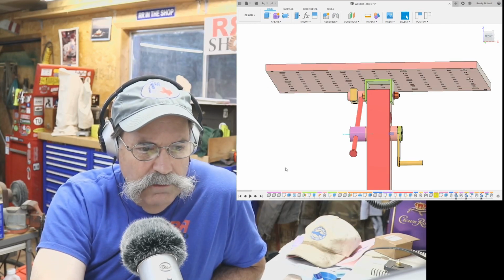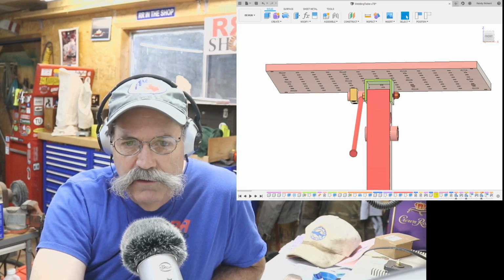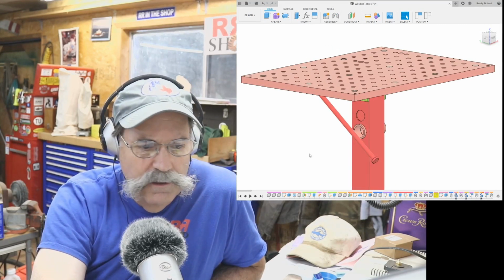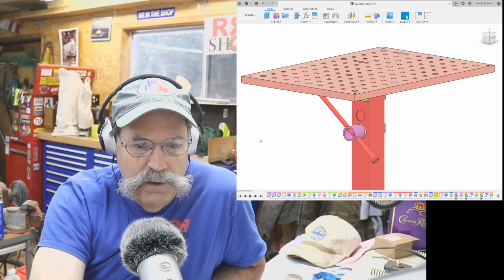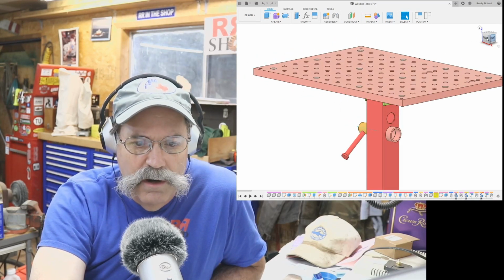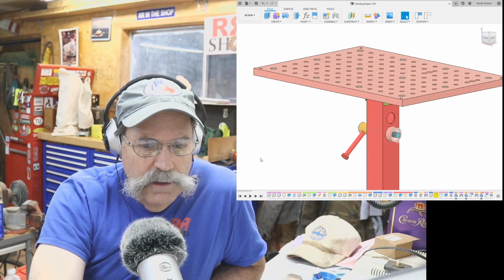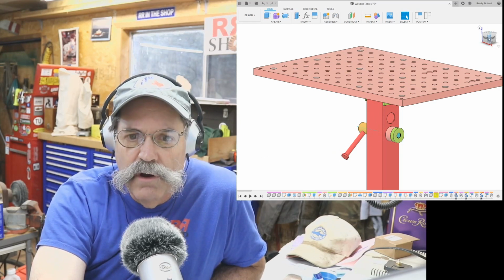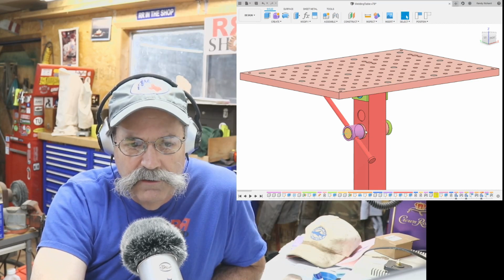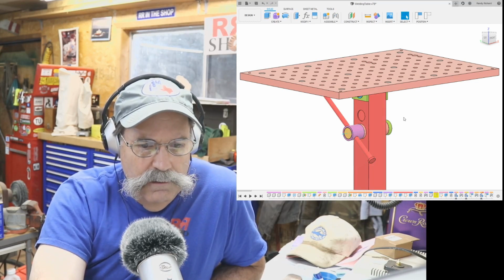The bottom slide, we'll show you that real quick. So basically, this is just a tube here, and inside will be two ball bearings, one on each end, just to make it spin really nice. Then we'll have a plug that will have a threaded drawbar, so that plug will be drawn with a drawbar, and then the hand wheel nut on this side, which you'll tighten to draw it tight, and then over this you'll have a sleeve that will be drawn. This will be pressing against the tube, and then you'll draw your drawbar and hold it all tight. And let's see here.